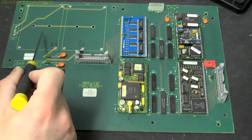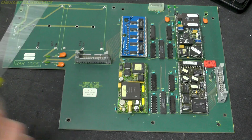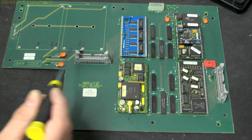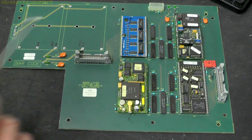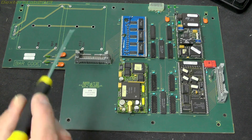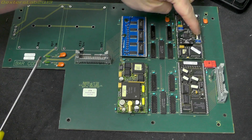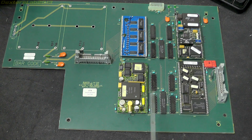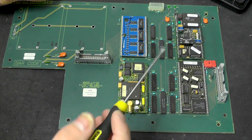So we had the two power bricks mounted here and here — these were mains operated, so we actually have mains on the circuit board. I'm going to change that: I'll just have DC on this board and have the mains in a separate chassis power supply mounted underneath. We can see the two 5 volt lines, positive and negative, coming into the circuit through two fuses, a couple of capacitors, then running over onto the rest of the circuit. This connector is for the parallel digital video input, and you can clearly see the connectors run up to this board and then over to the output board which goes to the coaxial serial digital output. The mirror of that is the serial input into one module running over to another module, then a parallel digital output with some glue logic all in between.